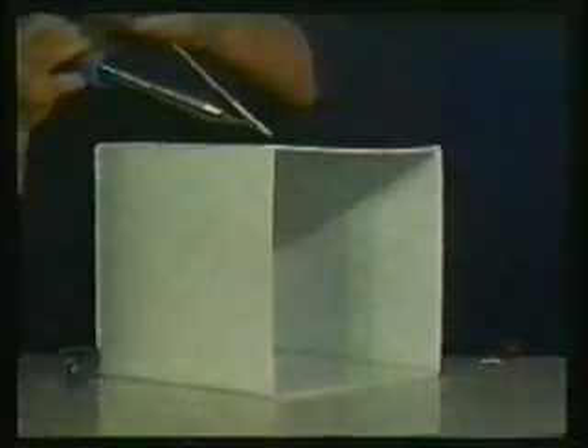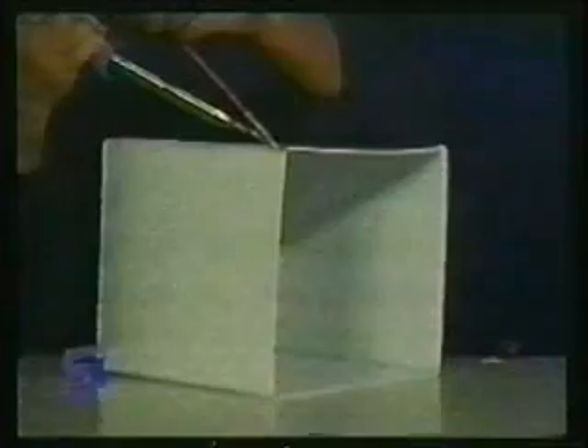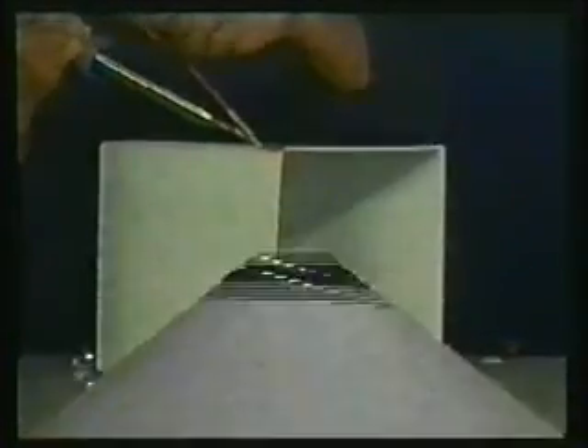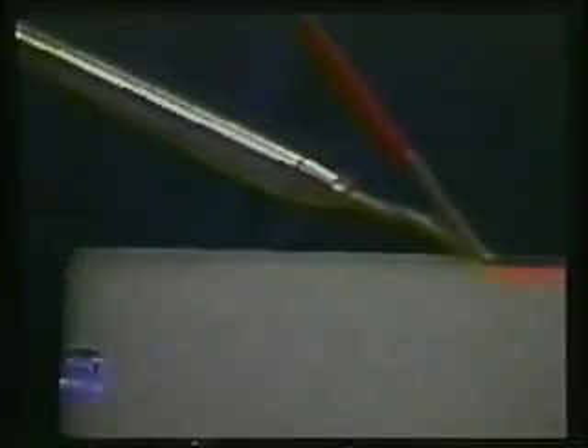Make sure your welder is set at the correct air pressure and heat setting for the thermoplastic material being welded. Cut the welding rod at a 60 degree angle and insert the rod into the feeder tube so the rod protrudes about one quarter inch past the end of the tip. Once started with the high speed tip, you must keep moving since the tip is continually softening the rod. To stop the high speed weld before the rod is fully used, set the end of the weld with firm pressure and draw the welder off the remaining rod. Be sure you do not leave the welding rod in the feeder tube or it will melt and clog the opening.